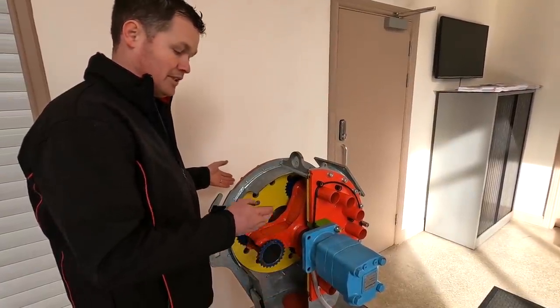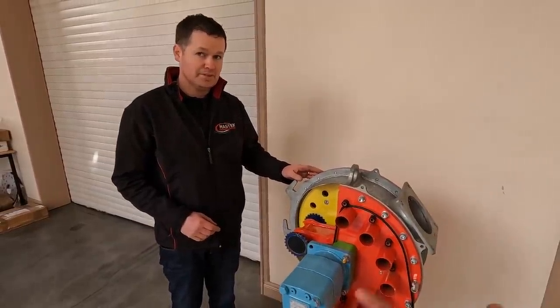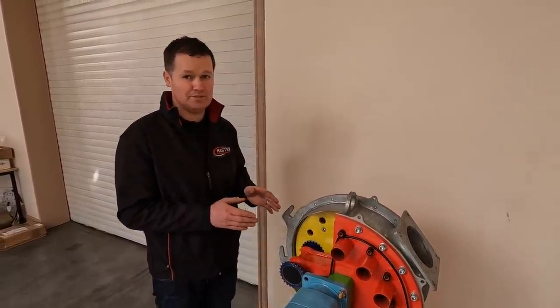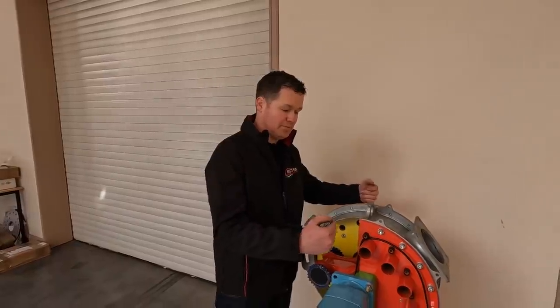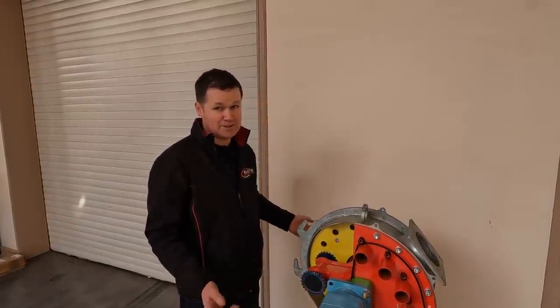Which means that it has nothing to do with what's happening inside the macerator, creating vacuum as it's turning. Yeah, it's creating vacuum, but the one-way valve keeps the vacuum equal, let's say, and it lets the slurry get air. And for that reason, because every pipe has its own independent air supply, it's getting the same amount of slurry, same amount of air.